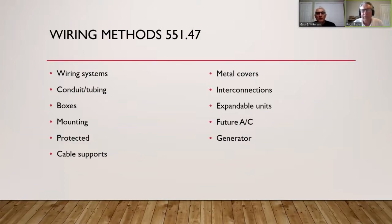You can put conduit on the outside of a wall — it protects the conductors inside. In a garage with concrete or block walls, you can't get down inside the wall, so you run conduit on the surface to get a receptacle where you need it. But in a tiny home where walls are open and studs are exposed, you'd want something flexible. You can use Romex there. Can you use Romex on the outside of a wall?